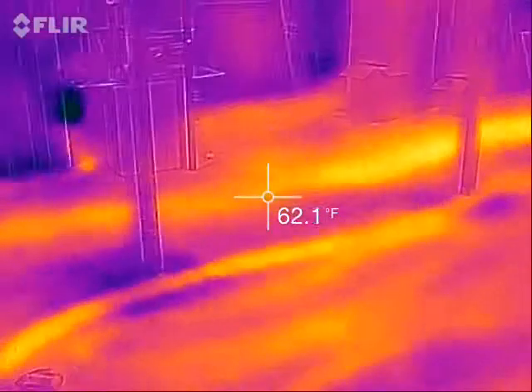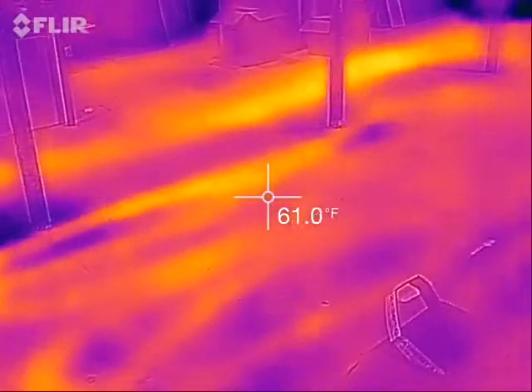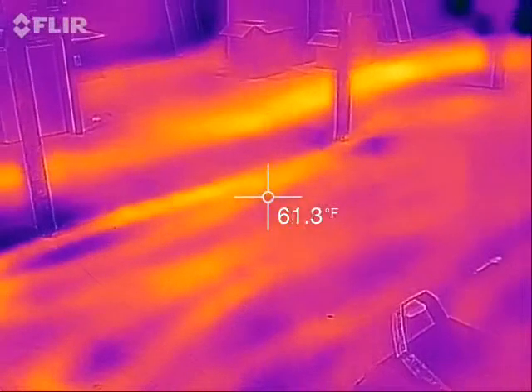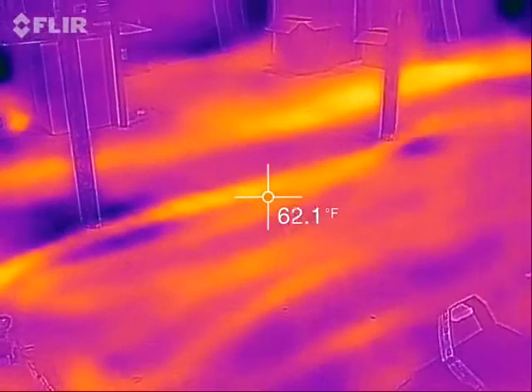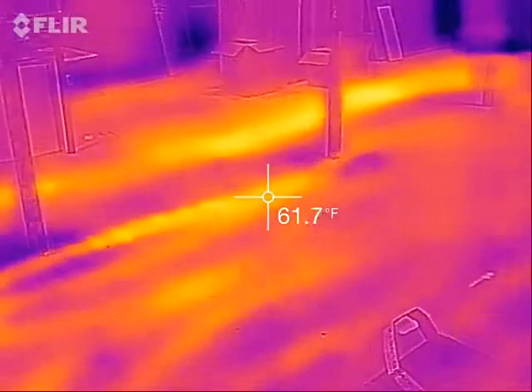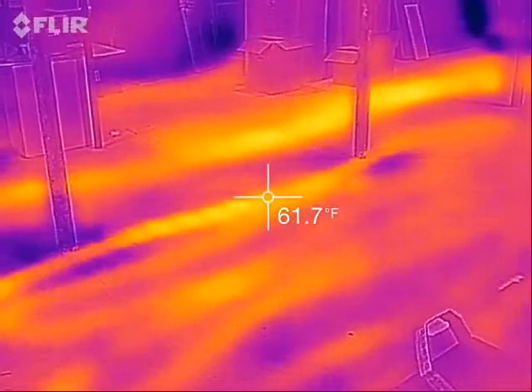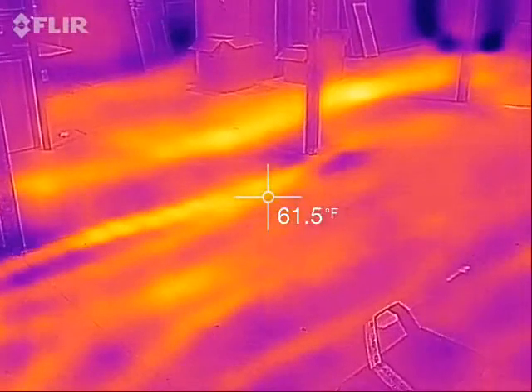It's curious to actually get to see how this works. It was set at 70 degrees down here, and that made the first floor quite cozy, but this uses an electric water heater so it's fairly expensive heat. I wanted to turn it down, so I tried it at 63 and that was too cold. So I bumped it to 65 and I'll look for occupant feedback on that.